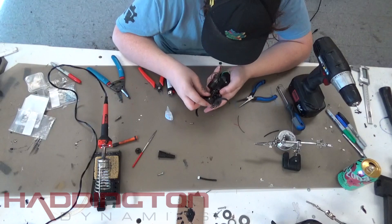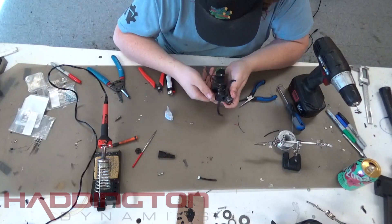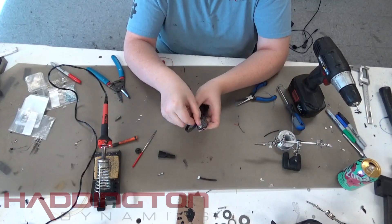When the glue has dried, turn the driver until the flat side is facing forward with the curved side facing you. This opens it for the gripper. Take the gripper and open it all the way and push the gripper onto the tool interface. This completes the tool interface sub-assembly with a gripper attachment.